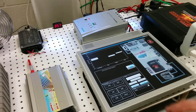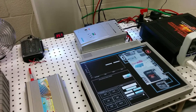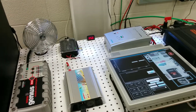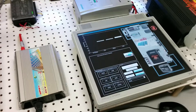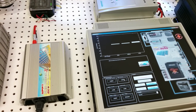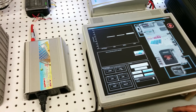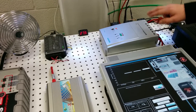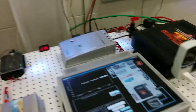Now let me turn off the charger and enable the solar relay. There are four relays here that we control on and off — connecting either solar to the grid-tie inverter or the charger. It's not the best time for solar right now; we're only getting about 5 amps at 12 volts, roughly 50 watts total. The solar comes in through a maximum power point tracking DC-to-DC buck converter, which steps the voltage down to approximately 12.5 volts.